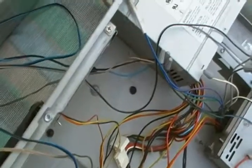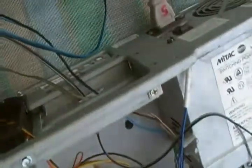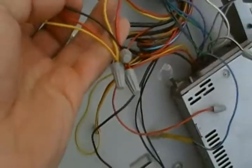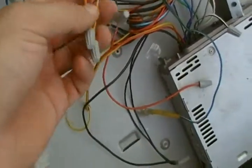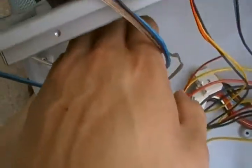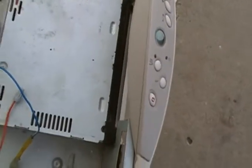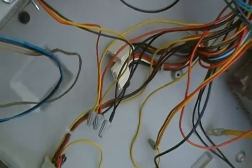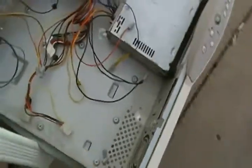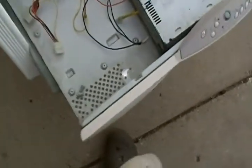For my fan wires, hook that up exactly color to code. Don't do what I did — I had it only hooked up to the yellow, the 12-volt, and the fan ran too fast and then died. But it has a little bit of extra airflow to suck all the hot air out, which isn't bad. I may stick an amp in here.